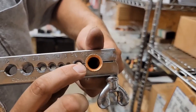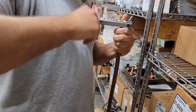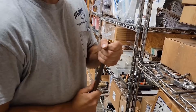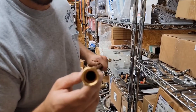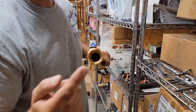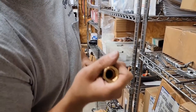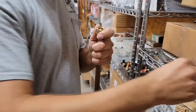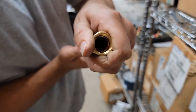See how that looks? Looks like I got a little too much in there, but that's okay. Let's see if the flare nut goes over — oh, look at that! I want you to see the difference in what the spin flare tool and the Ritchie tool does. You can see how that flare is there — looks okay. And it looks like I should have done a better job on the reaming and deburring, but you can see this flare.